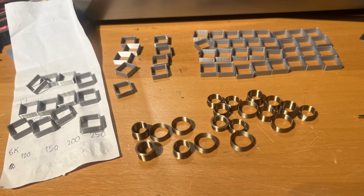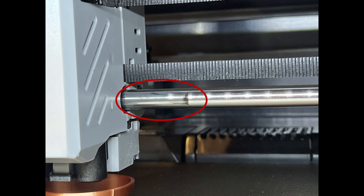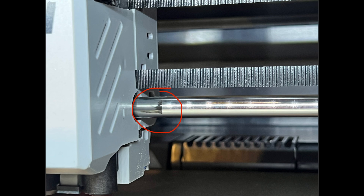After about 40 hours of test prints, I finally found out what was wrong with the machine. It turned out that the linear rods, especially the X-axis, were so dry and scratchy that it messed up the prints. I noticed that especially the lower X-axis started to develop all this dirt on it, so I wiped it out and oiled it, and after a few moves it was all dirty again — there was a lot of dirt inside.